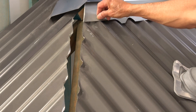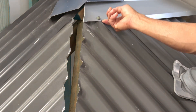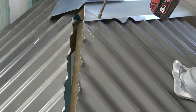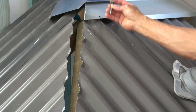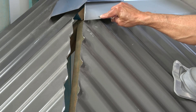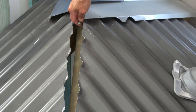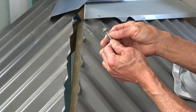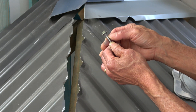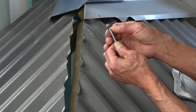Whilst this screw seems to be held tight, see how easy it is to unscrew? You've got a screw in here, you've got an enlarged hole and another enlarged hole right there. You haven't got a batten underneath to hold the screw in, and you're relying on this little bit of thread — which isn't a real thread, it's a stabilizing thread.